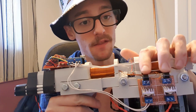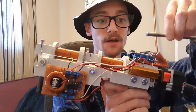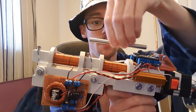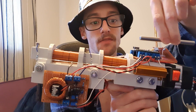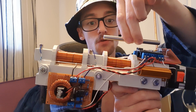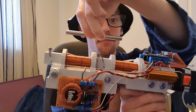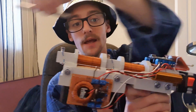They're protected by these flyback diodes. Essentially, whenever a coil forms a magnetic field, this is your projectile — it's going to want to be pulled to the middle of the coil, and then it'll stop right there. So the idea is that as the projectile is coming along, you turn the coil off, turn the magnetic field off, and the inertia of the projectile keeps it moving over to the next coil, where the next coil pulls on it and accelerates it more.